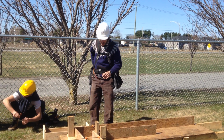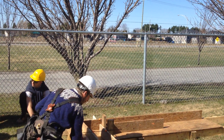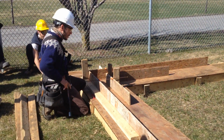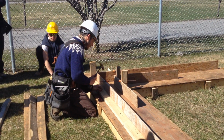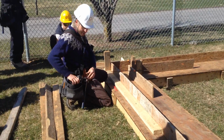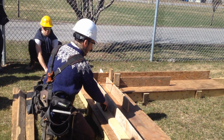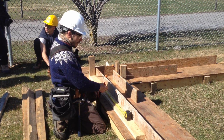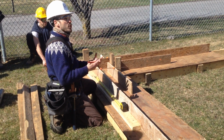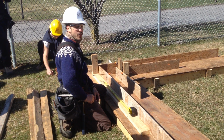Okay? Now, over here I have a rod, so I'll make a sign of a rod. I just make a line with a circle. It's a little symbol I make. We plant a nail. And what is the distance between rods that we said we're looking for? So 19 and 3/16 is basically the diamond shape. And why are we choosing this? It goes 5 times into the 8 feet, 5 times in 96.